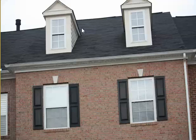At the top of the dormer, you have a valley directly above. That's where this roof joins the dormer roof. And you also have a valley on the other side. So if the roofers put nails anywhere within like 10 inches of the center point of the valley, that again will cause leakage down to the low point where they're having that leak above this window.